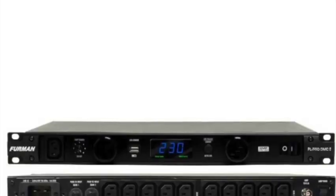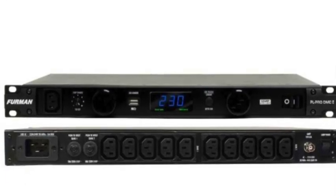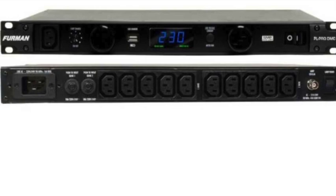Now, the second type of interference that you're likely to encounter is power related. This could be from any number of your outboard pieces of equipment, or even the main power supply unit for your actual console. Truth be told, if you're doing professional audio recording, you should be using a power conditioner. Everything you see behind me here is running through a power conditioner. We're using a Furman. There are other brands available. We're not sponsored by them at all. And like I say, everything here is running through that power conditioner.